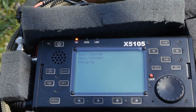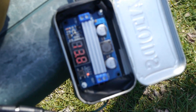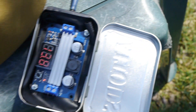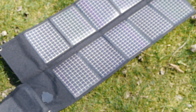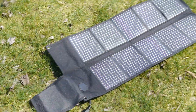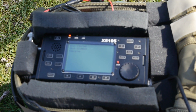I'm showing the charging setup. You can see there's a charging light on the top left showing what it's charging at. We have our power cable plugged in and from it we have the up-converter, which is running at 13.8 volts — that's my MOSFET up-converter in an Altoids can. Then we have the battery bank which it's taking the power from, with the power cable running out all the way to the solar panel setup. That's how I would charge up my Xiegu X5105 in the field from a battery bank or solar power in an emergency. That's my full Xiegu X5105 HF ham radio operation kit deployment.